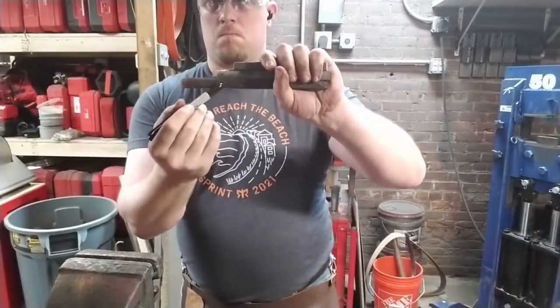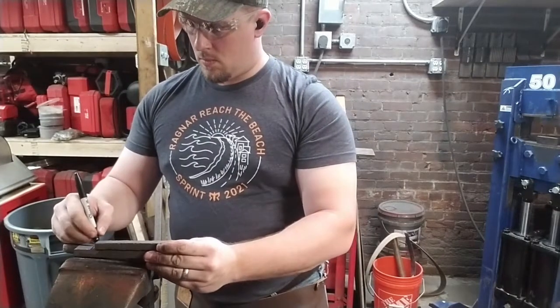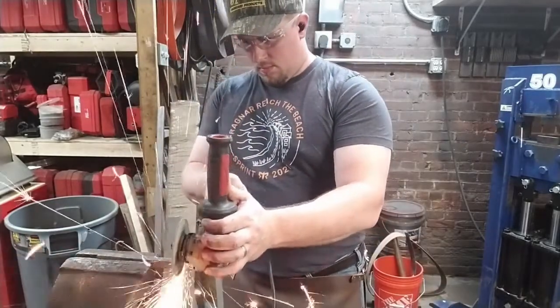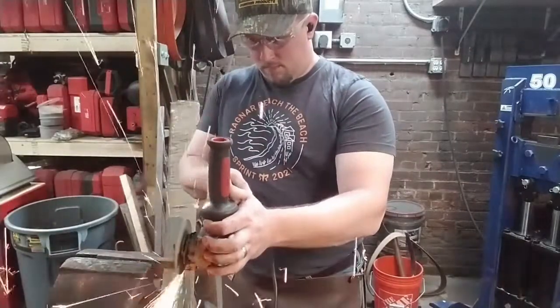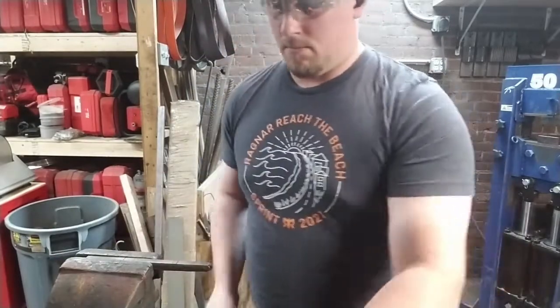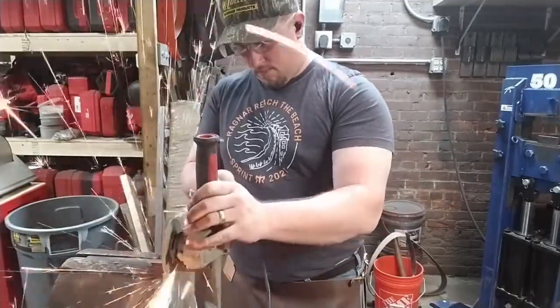Now we have our bars fitted tightly together, it's time to trim them up. You'll notice each one is a different length, and that's purely by accident. It's absolutely possible to work with different length stock and weld up a successful blade, but not to get the blade that we're looking for. We're going for a Norse Seax, specifically a Norwegian Seax this time.